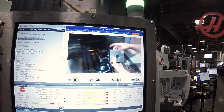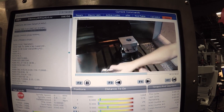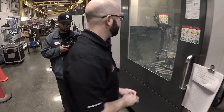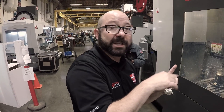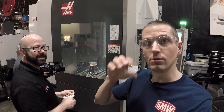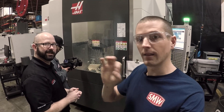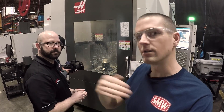This is amazing — a video showing the right way to flip the part. I make notes, take pictures, even make videos for myself on how to hold parts because I forget on repeat jobs. I could have loaded the part wrong, so we actually used the probe to make sure I didn't. This is not just probing but also QC — if I loaded it wrong, it would alarm out with a user-generated alarm. You can put pound-3000 equals one: 'Mark is dumb and loaded the part wrong' — and it'll pop up on screen. Mark is also helping because we do G68 rotational. One thing I don't like is if I run another probing routine to check Z, it'll sometimes wipe out my 189 parameter, which is a big problem because I need that offset in my parts. It's easy to write a check: if the value is not only zero but null — null and zero are two different things — the Haas will say it's not there, remeasure it, alarm out, and don't make bad parts.